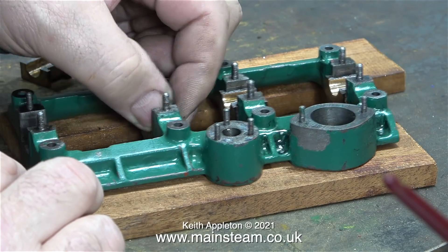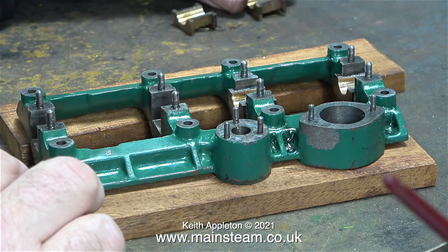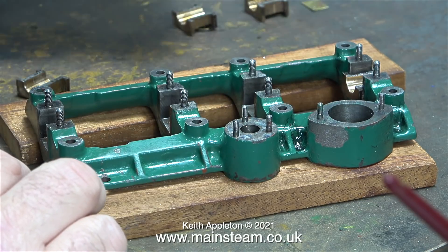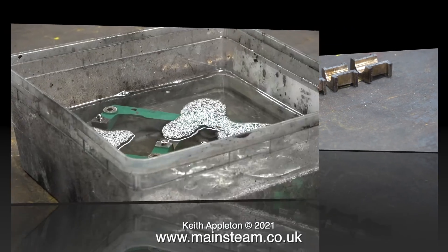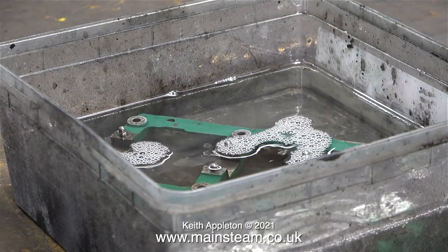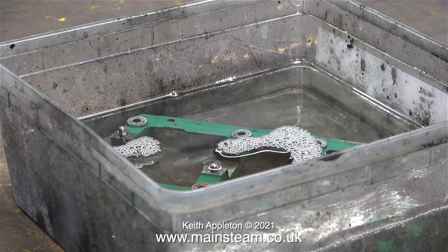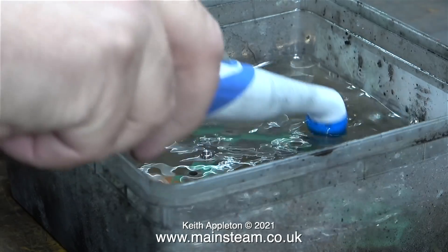I've decided to remove the bearings, putting them exactly in the right order — each of them has a shim, and the bearings and shims need to be fitted back to the sole plate in exactly the same order as I took them out. Once I finished the painting, I filled a polythene tub with gun wash — cellulose thinners or lacquer thinner — and submerged the sole plate in this liquid, which should dissolve the paint.